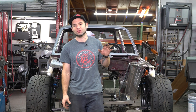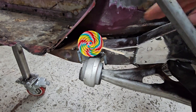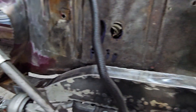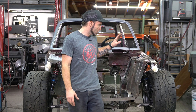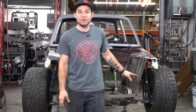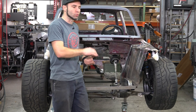I know some of this didn't look like a ton of work, but I can promise you notching the frame twice actually was a lot of work — there are a lot of details and labor that go into that. We had to notch for the subframe to go up, and then of course that brought the lower control arm rear bushing mounts — which are called lollipops — up into the frame. Trust the process: we're going to be building boxes up above the frame, and those are going to be part of the integration of the engine, coming in a later episode. The exciting thing here is we didn't have to modify the steering rack, crossmember, or subframe from the E46 donor parts at all. So if we ever have to replace those, we can easily replace them with stock components from a junkyard.